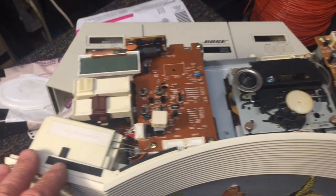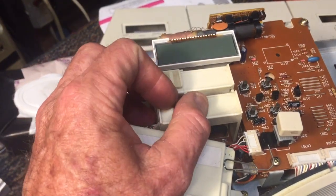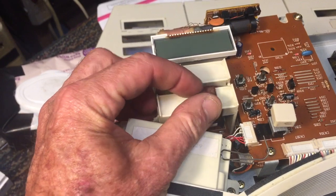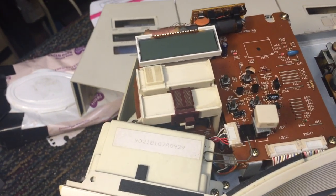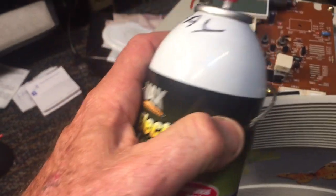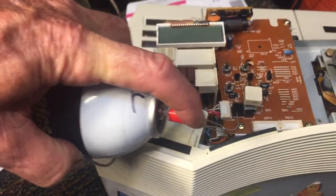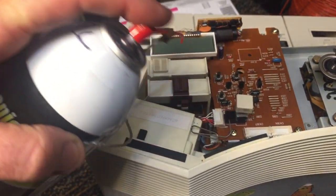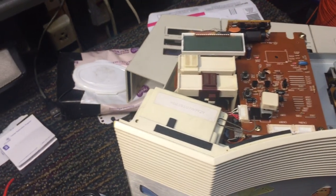When I hooked it up, one of the first things I noticed was a very staticky, intermittent sound when I slid the volume control up or down. That's a fairly common thing on older stereo units — you'll hear a crackling noise when you turn the potentiometers. It's usually an easy fix: take electronic cleaner and lubricant, get underneath the slide potentiometer, and spray so the solvent reaches the contact points. That took care of it.